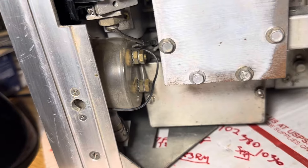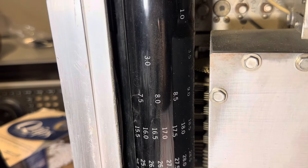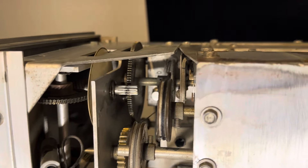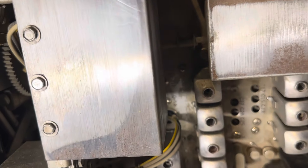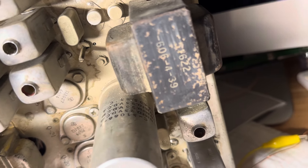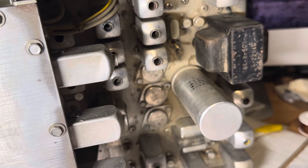Hope you enjoyed my little tour of the HRO 500 receiver, circa 1965. These were made from 1965 until sometime in the 70s, maybe '75 or '78 — I'm happy to have this one, it's in a fixable condition. There's a big nasty capacitor but all this stuff is low voltage — 25 volts — so I can replace these things with tiny low capacitors. I'd tear that thing out and put a capacitor inside of it and rebuild it so I don't have a butchered-looking unit.